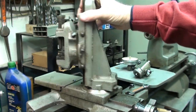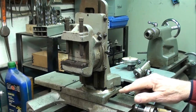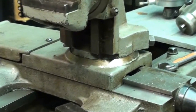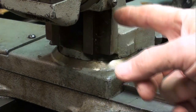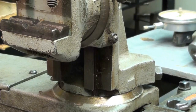After you install this it can swing at different angles. Probably the most common angle is 90 degrees, and we're reading it right here on the little protractor — it reads 90 degrees right now. Then you tighten the two screws. Make sure you get them snugged up real good so you don't have any vibration. The fact that it hangs over somewhat from the cross slide does cause it to lack some rigidity.